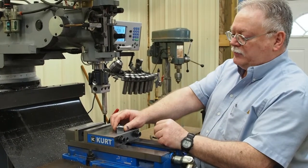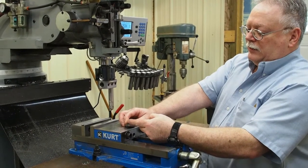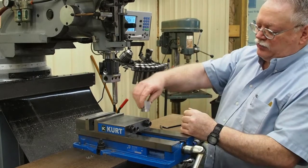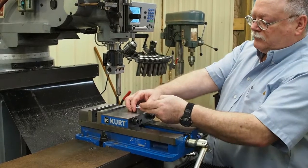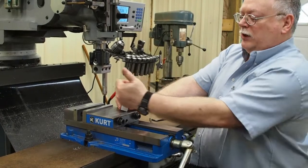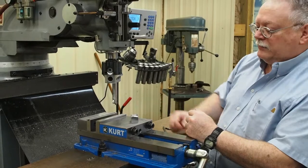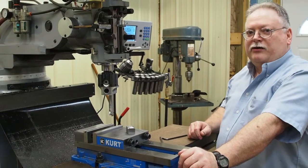Right now we have the radius swept on this block — probably about one inch and a few thousandths on the radius. When I grind this that will leave a little bit of grind stock. It doesn't have to be perfect; it's just a sweep point that's going to be on the nose tip. If you need to do something precision like this, you can also indicate the back of your block and know where you are, and put that radius wherever you want — on center or wherever you need it. Just a little tip that you can use your boring bar to do neat things like this. We'll finish the block up in part three, then we'll get it heat treated and start in on the grind process. Thanks for watching.